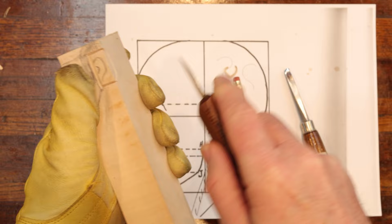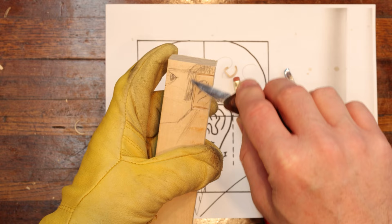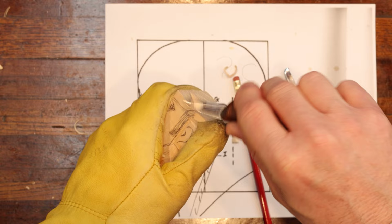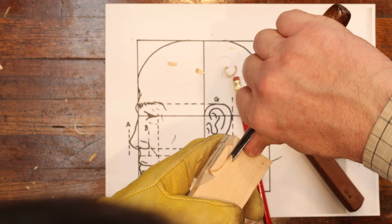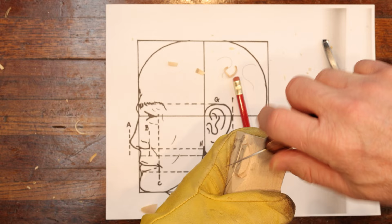And all we're going to do is just try to bring this out, we do a little relief carving, what we would call. All right, so this would be your jawline right here. This is your jaw, this is your sideburns, that's your eye, whatever. And so we're going to come in here and start relieving the bottom part, come in here and do the top part, and get that to stand out just a little bit. And we're doing it on a corner. And later on, we'll show you how we do it on a full piece. But I just want to show you today the basics of an ear. And we're coming in here and getting rid of all this excess, and taking our V-tool here and making these cuts to establish a foundation to get our ear shaped.